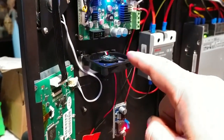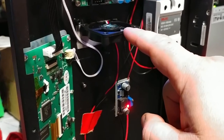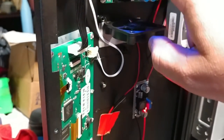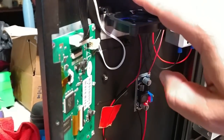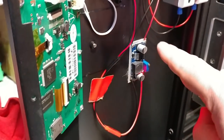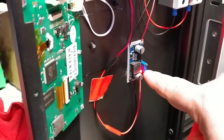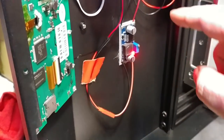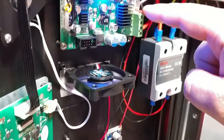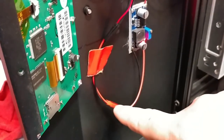I replaced this fan with a 50 millimeter 10 CFM fan - it blows pretty good, really good air. I overvolted it by one volt; I think it'll be okay. Here is the buck converter which drops the 24 volts down to the 12 and a half, 13 volts that I have it running at, and it runs into the fan. I used the existing wire to go to the buck converter.